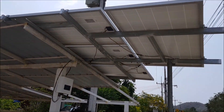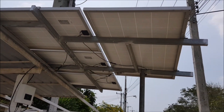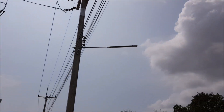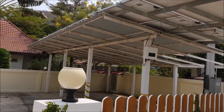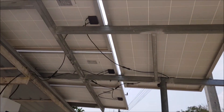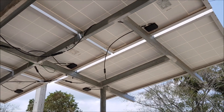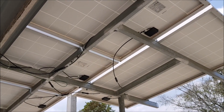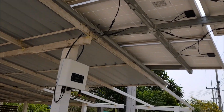One of my three phases did not have any solar system on it, so I found a place here at the car park, above which there is the off-grid system. I added four panels, but because of the shadowing situation — there's a power pole here and another one with a transformer right there — there's almost no situation where there's no shadow passing over these panels. That's why I thought the best idea would be to use microinverters, so I bought inverters which could fit two panels each, and split the four panels across those two inverters.